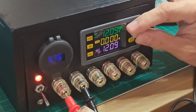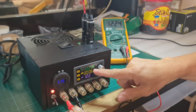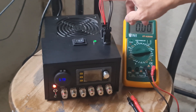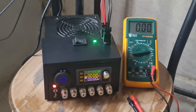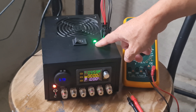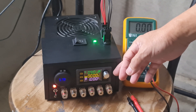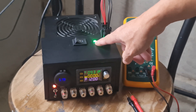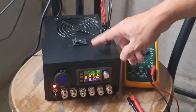If I switch to the right, the converter gets supply from the solar panel. I use my 6-watt mini solar panel with an open-circuit voltage of about 10 volts — so for now the converter is solar powered. I put a green LED indicator light so that I would know if the supply for the converter is from the solar panel or from the ATX. If this light turns on, it means the converter is getting supply from the solar panel.